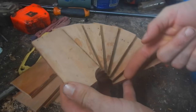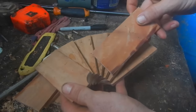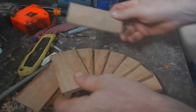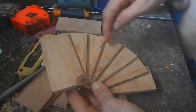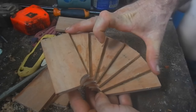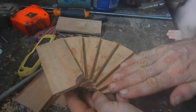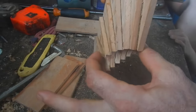Someone's going to ask: why do you make this corkscrew-y shape instead of just having a propeller blade that's flat? It can't just be a flat thing because the distance the propeller blade travels on the outside is much further than the distance it travels on the inside. So this part is only traveling this far, and out here it's traveling that far. When this travels this far and that travels that far, they have to travel the same distance through the water — so it's got to be twisted. Obviously this can't all be steps, so I'm going to use an aluminium flap disc to smooth it out.